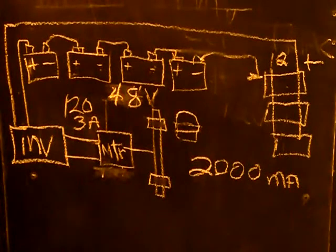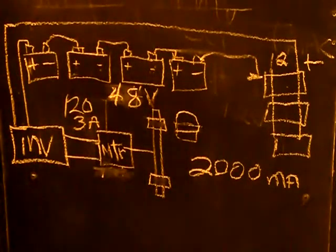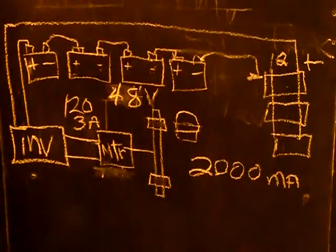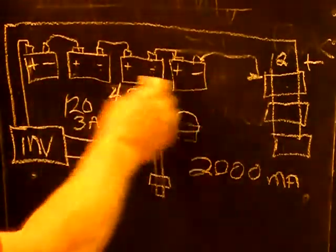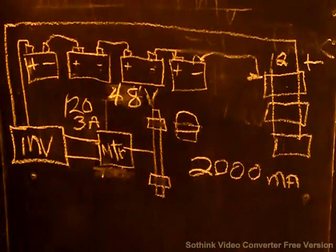Now you can buy these grid type inverters. We really got an advanced society now where our electronics is really moving along. So you can buy inverters that are 22 volts to 60 volt input, and anywhere in there that you want to put voltage in, it comes out 120 or it comes out 220, whichever you prefer or need. So in my case, 120, and if I put in 48 volt, well, 48 here and 12 there, and take away the differential, that's 36 volts going to my inverter, then I won't need 30 amps anymore.